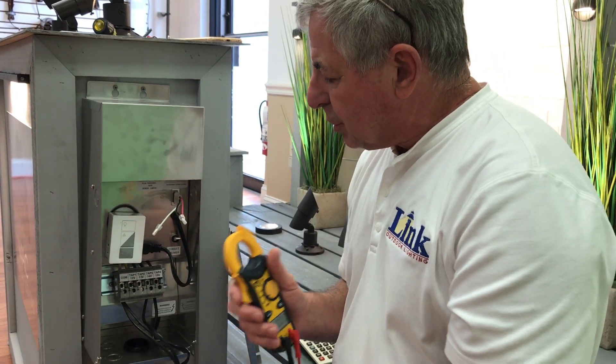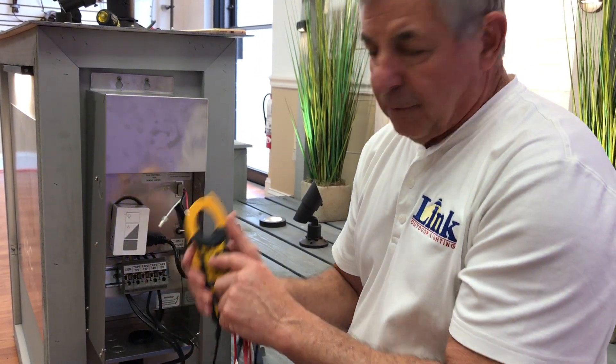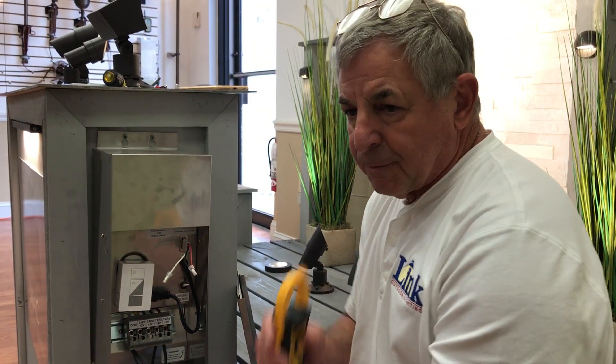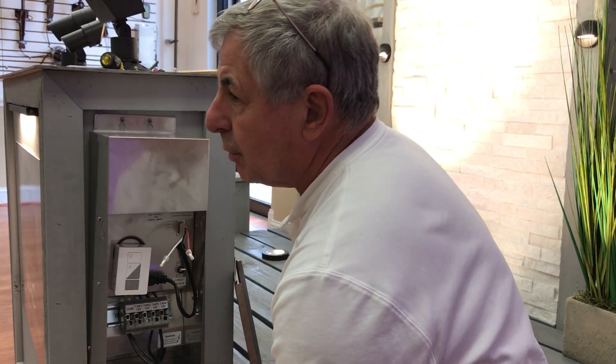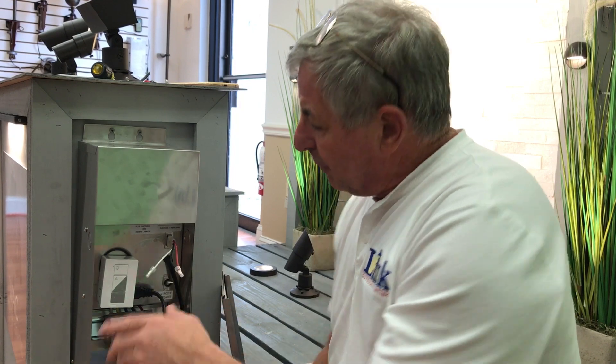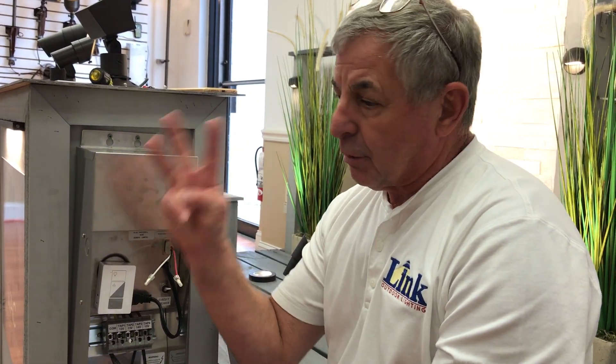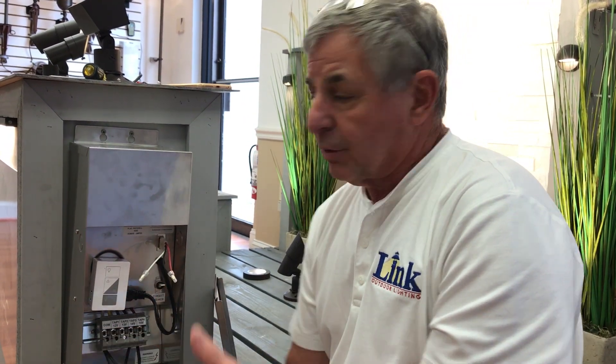That makes sense — you'll have lots of questions, give us a call. This is just the basics: primary side, secondary side, amps on the squiggly line, volts on the squiggly line. One other thing we get a lot of questions about — guys will go back on a job and say 'I don't even know what size transformer this is.' Every transformer that is legal to put on somebody's house has a sticker that says 'Do not exceed X amps.' In this case it's a 300-watt transformer, 2.5 amps. So here's what you do: multiply 120 times 2.5 and you get 300 watts. Multiply whatever the amp sticker says by 120 and you'll get the size of the transformer — 300-watt, 600-watt, it's going to say 5 amps, and so on.